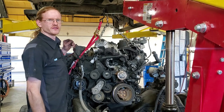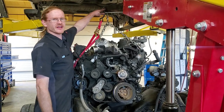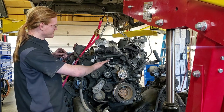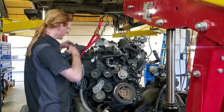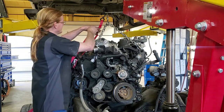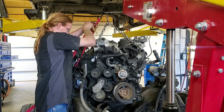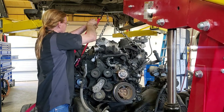This is where those swivel attachment points on the side of the boom come in really handy. We've got a 6.4 Power Stroke here and the way we've got it rigged, it's leaning to the passenger side quite a bit. So I hooked on to the alternator bracket and up to that attachment point with a little ratchet strap. Now I can easily adjust the load.